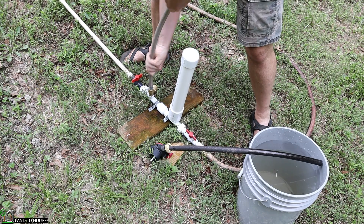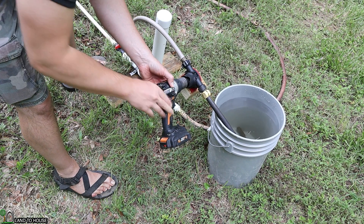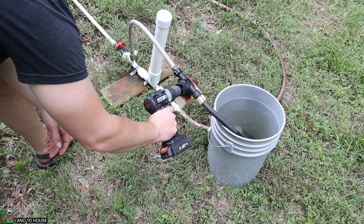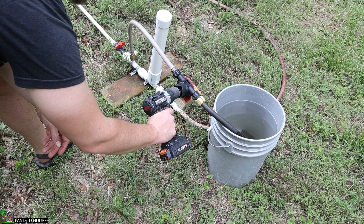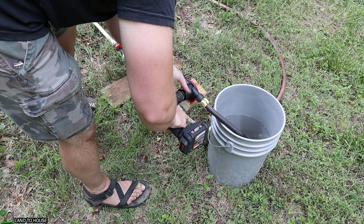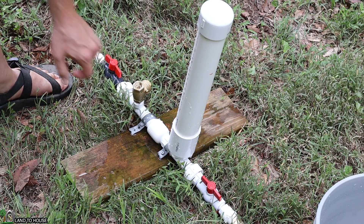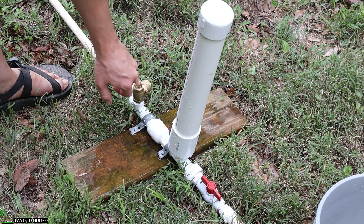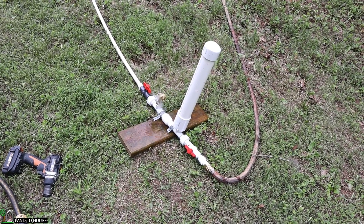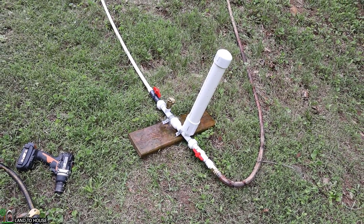Makes it really quick. With the drive pipe closed and the delivery pipe open, I've got my drill hooked up to the drill pump and I'm going to fill up that delivery pipe. Let's see if that's sufficient to get this ram pump running on its own — if there's enough water going uphill, I should be able to get it running pretty quickly. The pump is now running very consistently, and I can tell there's already output at the top.